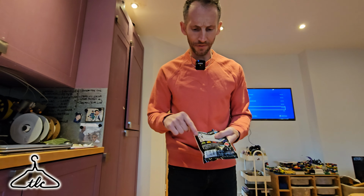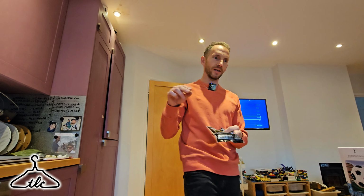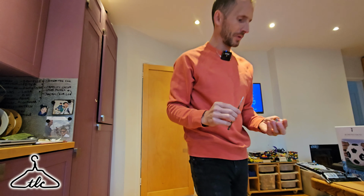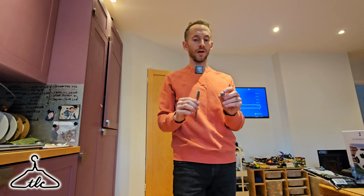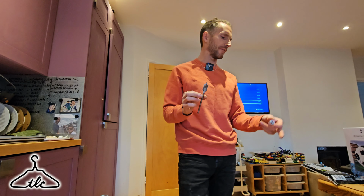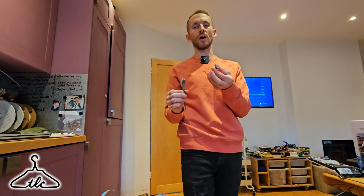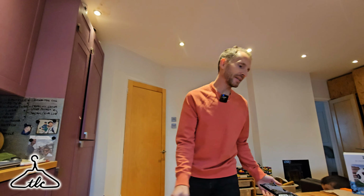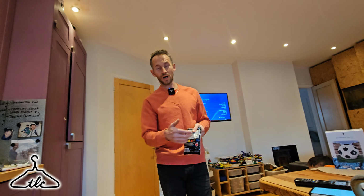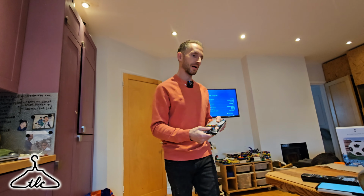But I do believe that whatever bracket you have, you just need to make sure that you have the right size flat bit. I've got the red color-coded version, which does 74 kilos, and it asks for an 18mm hole. Okay, so if you are going for any others, look in the instructions. It might be a 15mm hole, it might be a 20mm hole, etc. Other things to be aware of is the weights and loads. Talked about that. So whatever color code you've gone for, different size hole, drill bit, etc., different loads.